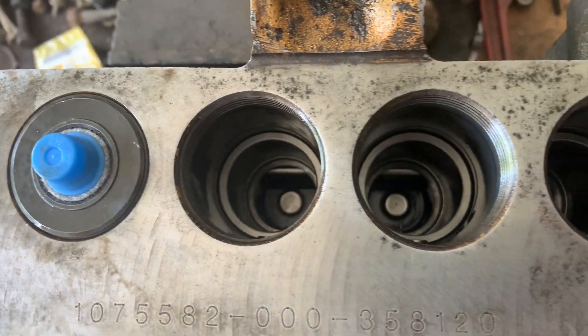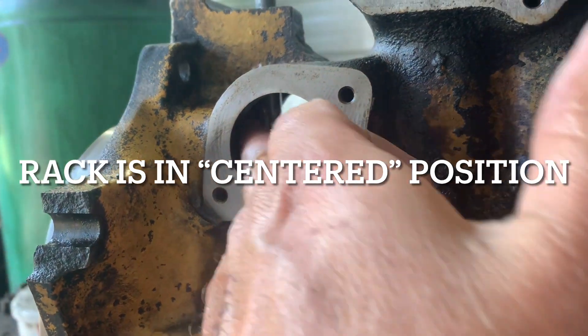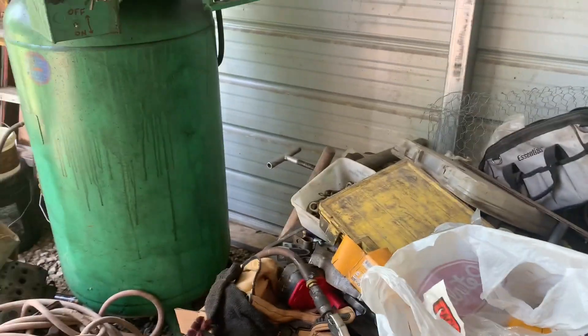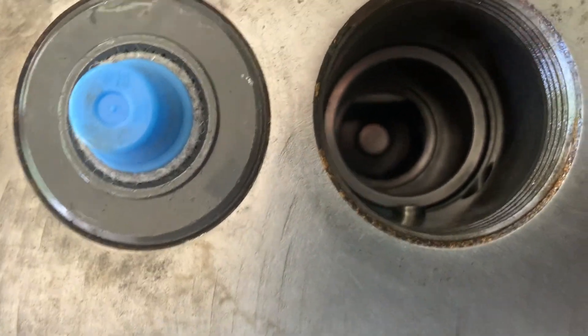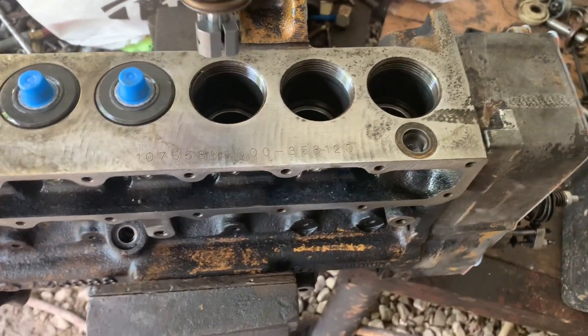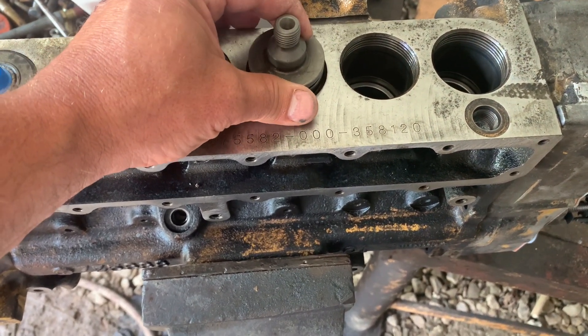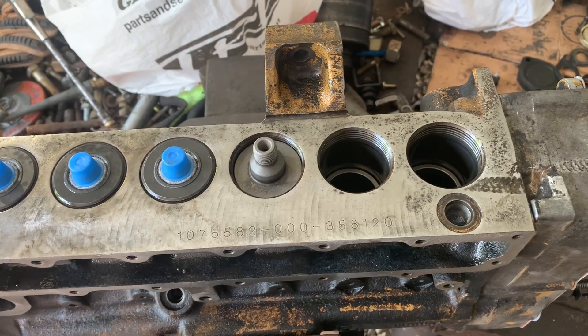I have put the three spacers in place. Verify that your rack is pulled all the way back with the pin in the groove. You can see the slot at the top of the pump rides in, and there is a little tit down in there on that lifter — that's where that rides. Let's drop it in very carefully. I'm going to prepare a bonnet and a bonnet seal, put that in, and then check my timing.